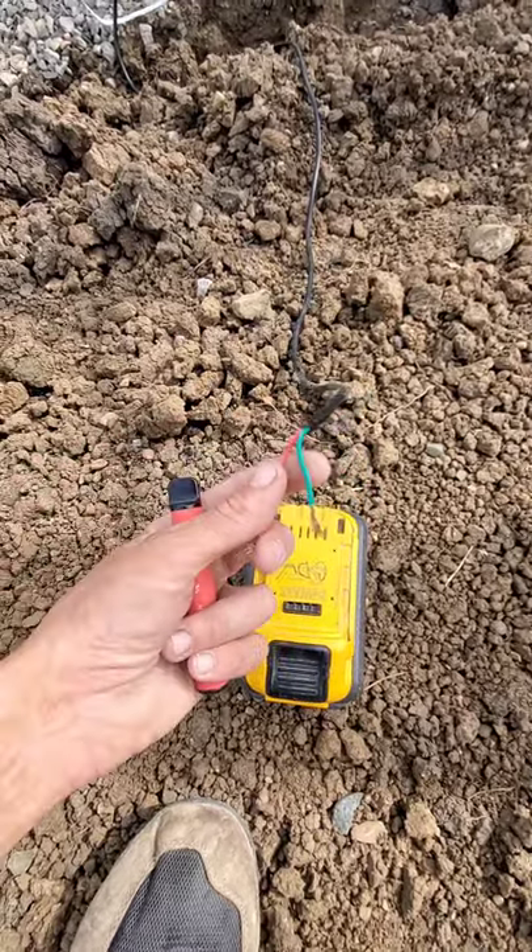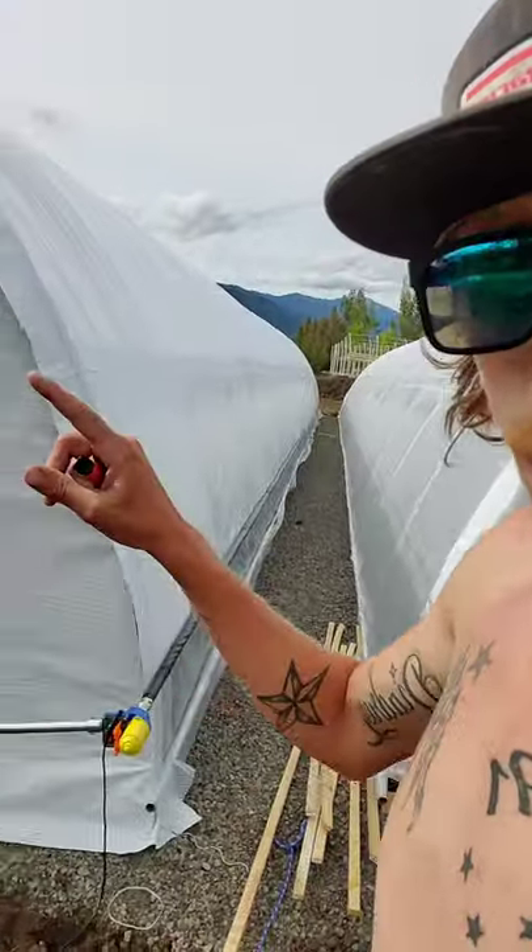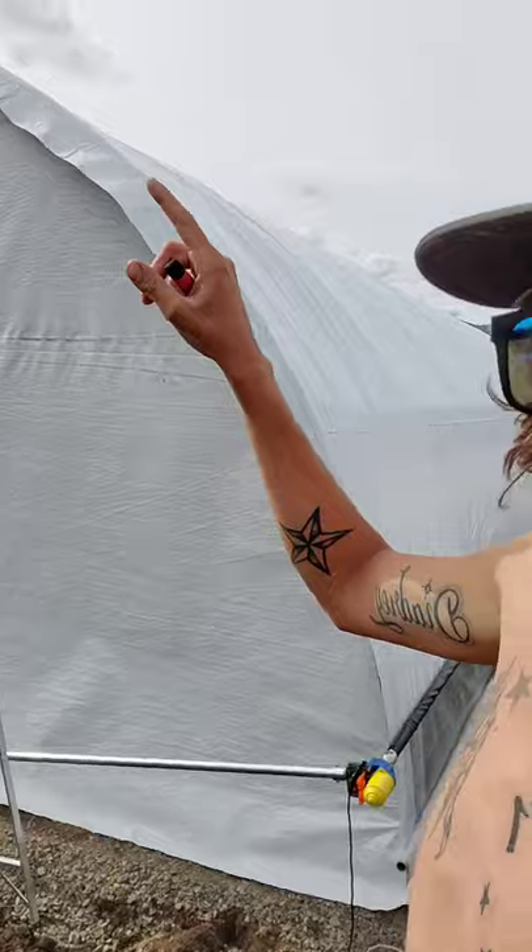No wrong way to hook them up. When I get this rolled all the way up, about three quarters of the way, I turn the dial that's going upwards to zero. What I do is walk the motor up by pressing the button, letting it go one rotation and go click, then press the button again, let it go one rotation. You always want to have a little bit of variance — you don't want to get your roll up really close. I like to leave it 12 inches at least from the center.